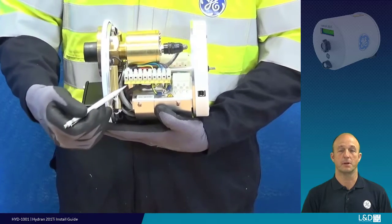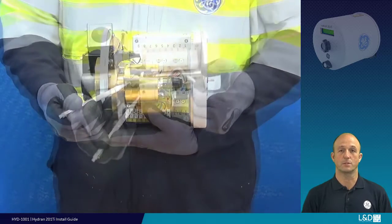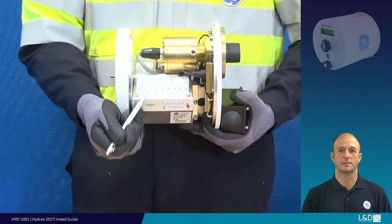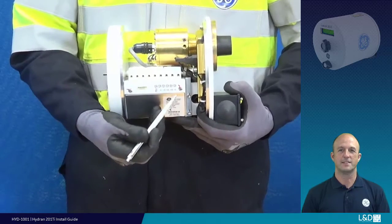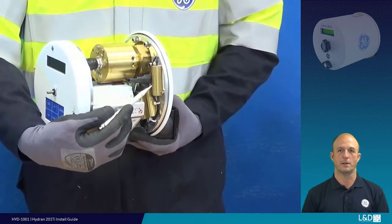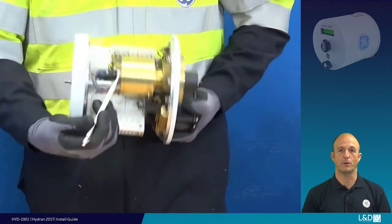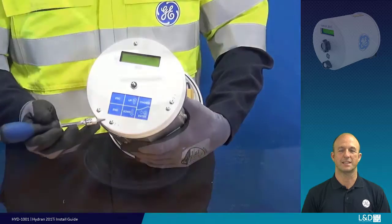Here is the supervisory link terminations for connection to optional controllers or daisy chain up to a maximum of 32 units together. This is the Hydran gas sensor — we will look at this in more detail shortly. On the circumference there is a bleed screw and bleed port. On the right hand side there are three dry contact alarm relays: one for system alarm and two for gas level alarms. These are LED diagnostic indicators — they inform the operator of the state of the system and power supply. This is the unit base plate with resistors that heat and cool to modulate sensor temperature, to assist with thermodynamic oil flow.